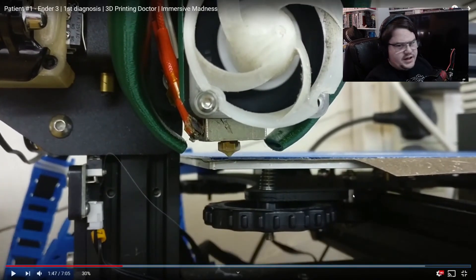It's either that fan not doing its job, or the design of the cold end part — the heatsink — not taking heat away fast enough. Then the same thing will happen. So another point: being an E3D style, if it's not an official E3D hot end, the clones tend to be a lot cheaper because they don't go through so many manufacturing processes. They don't necessarily make it to the same tolerances that E3D do — that's why E3D costs a lot more than the clones. That in itself might be a problem, because if the heatsink design is not very good, it will allow heat to creep up and melt further up in the actual throat of the mechanism.